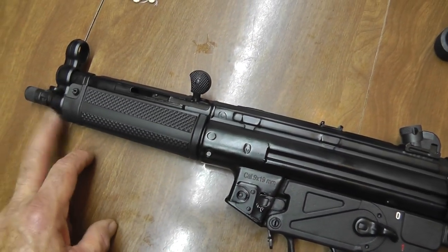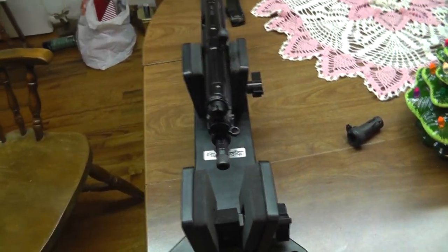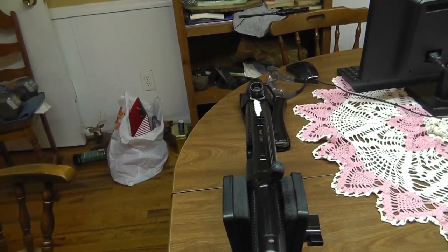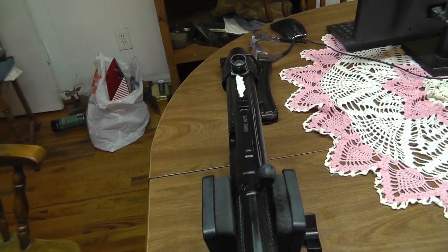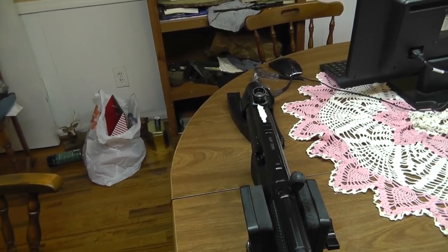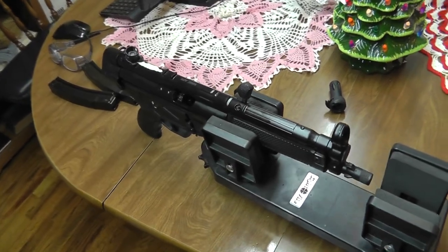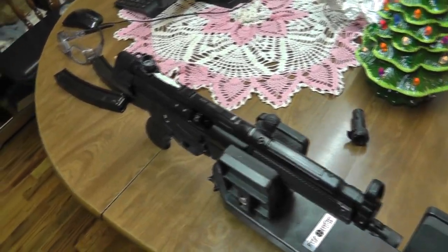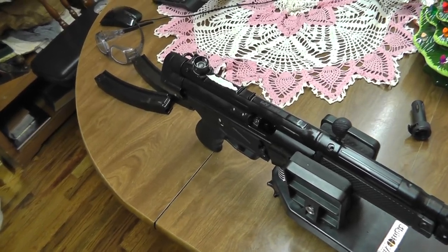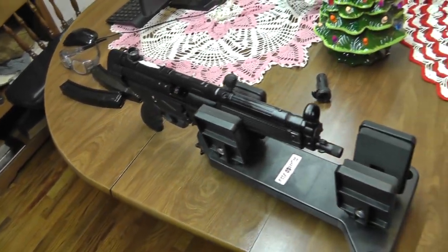Another complaint I've seen is the sight tower might be crooked. But your front sight tower on this is perfectly straight — absolutely perfect. You can see the weld on top here for the cocking tube — it's perfect. I built an HK-style firearm from a kit using a Santa Barbara barrel years ago, before I had a YouTube channel, and it is very important to have all this stuff straight. The bolt gap on this one measures out at 16 thousandths of an inch, which is excellent.